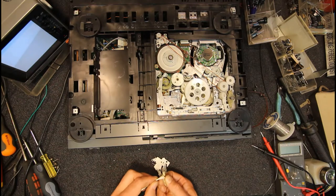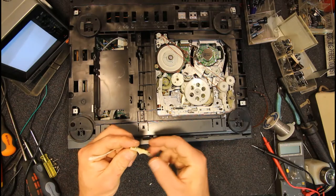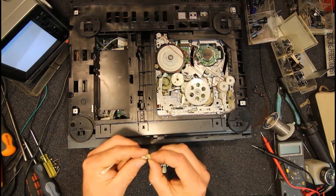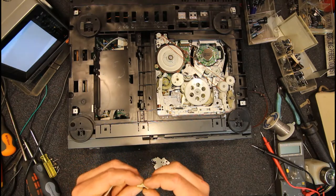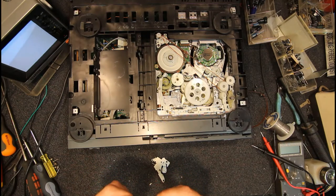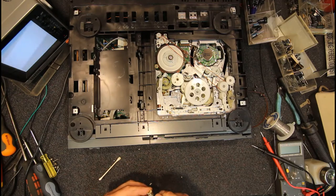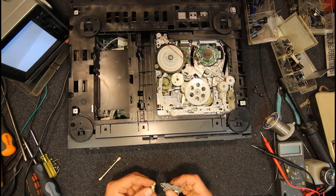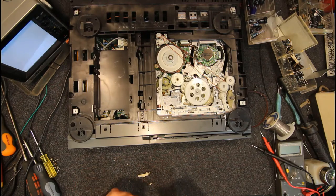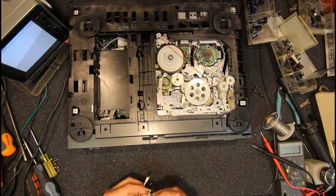And same on this little hole through this brake lever. That's just got a little felt pad on the end here and this spring on the side. It probably should sit under there, but anyway, I'll leave that untensioned as much as possible so it doesn't fly off. Now, ideally, I probably should clean down in that hole, but even just putting it back now will move it. But I'll rub that up and down here a bit and then wipe anything off that it leaves behind on this shaft. It's often the easiest way to clean it out.